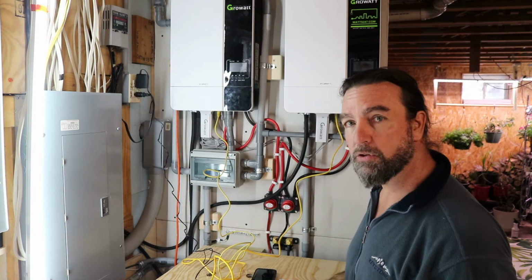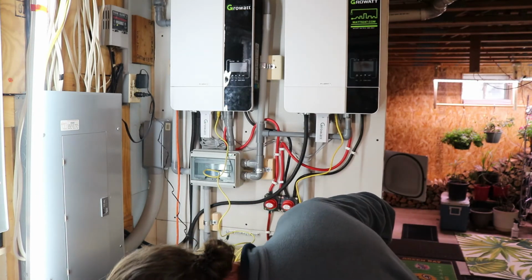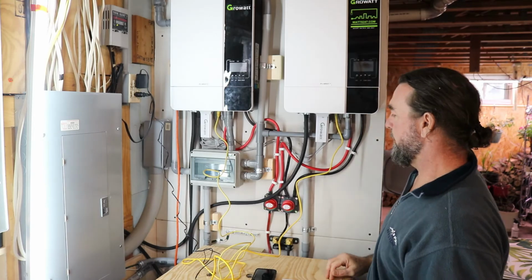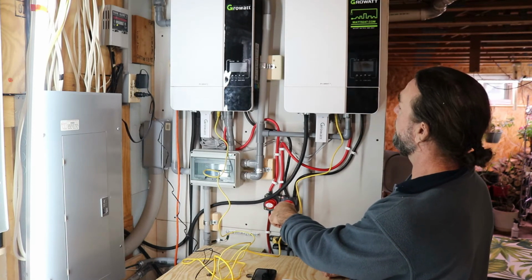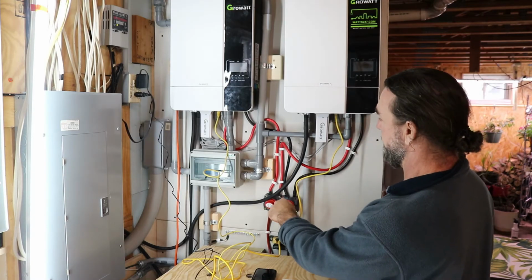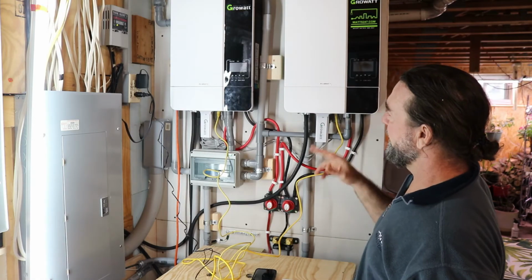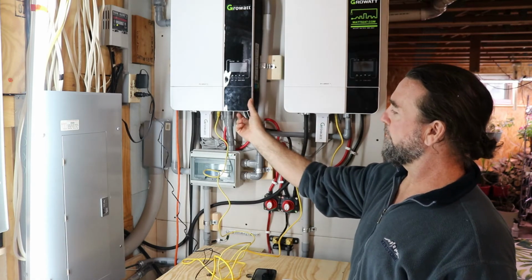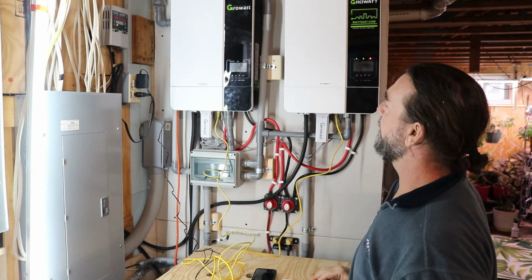The on-off switches on the batteries. I'm going to verify them. On, and I have 4 batteries. Then we're going to turn on the quick disconnect here for power. You want to make sure these inverters are off before connecting that on. We should get it to fire up once we turn an inverter on. And it should take away our error 56.